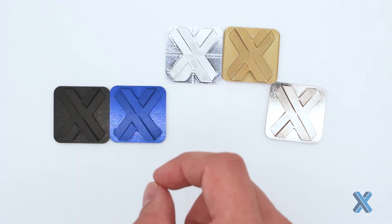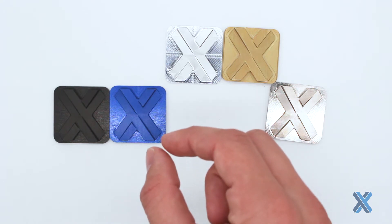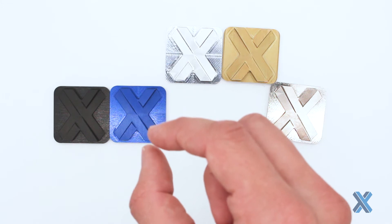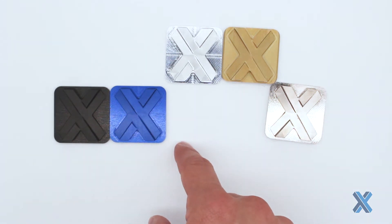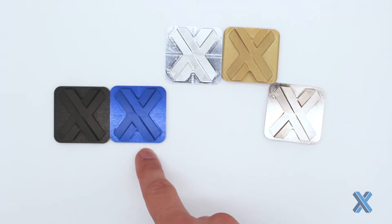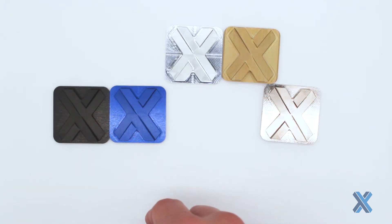Going the other direction, when I go to anodize, I'm controlling corrosion on the outside of the part by doing a dip bath and controlling an oxidized layer. Type 2 is just a little bit of oxidation on the outer side that is even and controlled — that creates corrosion resistance and turns the outer surface into an insulator, so you don't have a conductive outer surface. That oxidation layer can be pigmented, so in this case I have a blue anodized part. Very common to see reds, yellows, purples, and of course black anodized.